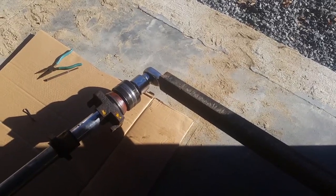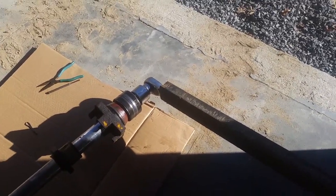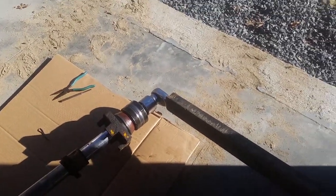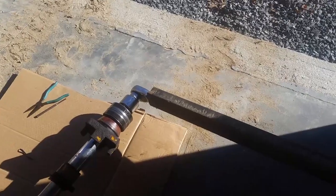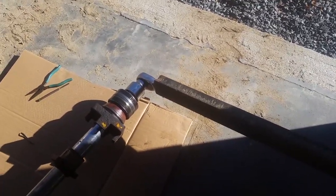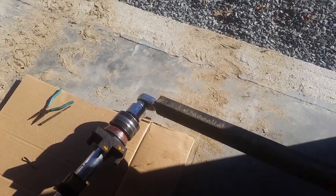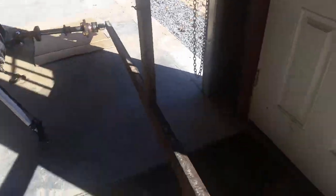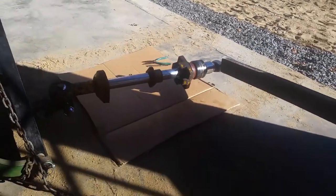The next thing I need to do is crack this nut, because I need to be able to get this separated. Now that the pin's out, I can try to crack that nut loose. There are a lot of ways to do it - I don't like putting impact stuff on it. Usually what I do is take a three-quarter inch ratchet and put a long rod on it, probably 10 or 12 feet. We'll see if it cracks loose or if I'm going to struggle with this.